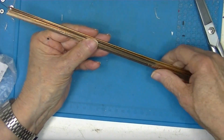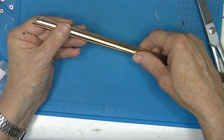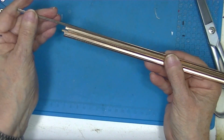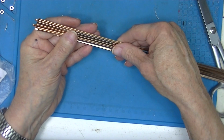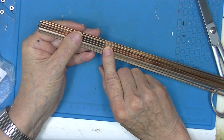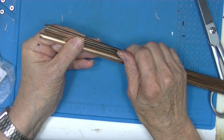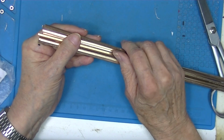I was hoping that these were silicon phosphorus high temperature soldering sticks. Filler metal, if you will. When putting air conditioning and sometimes hydraulic systems together, if you're using soldered fittings, especially in air conditioning, where vibration is a problem, it's wise not to use solder, even no lead solder, that you can melt with a low temperature